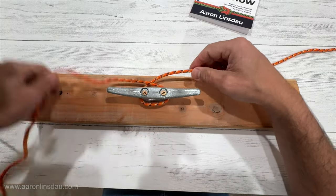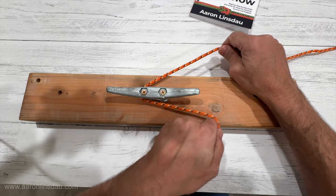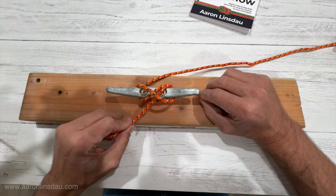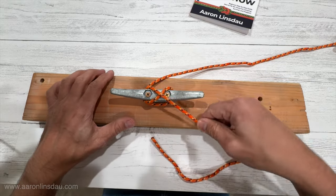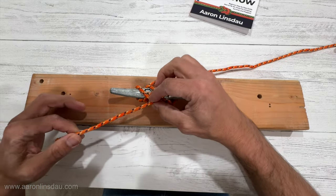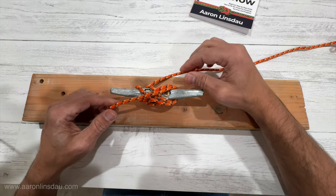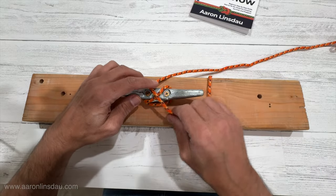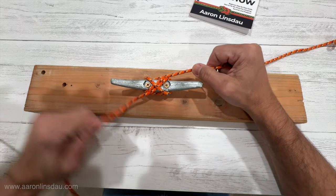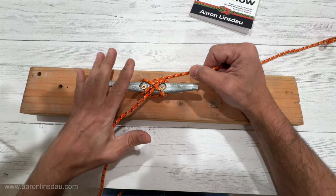Most importantly, with huge boats, you do not want to put the lock on there. So you've got your huge boat — your ferry. You come around, you tie it like this, and then instead of the traditional lock off like we do with small boats, all you're going to do is come around and just let it literally sit there. This is with a hawser — not this skinny little line. We're talking a rope like the size of your wrist — huge stuff. And the reason is that if there is an emergency and you have this lock engaged, and there's an emergency on the boat, if the boat's tension tightens too much, you will not be able to get this lock off, which can be extremely dangerous for big boats.